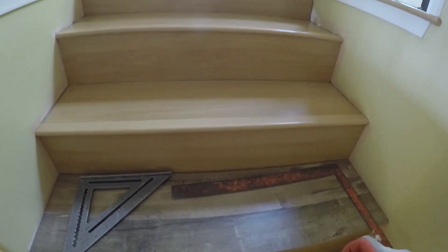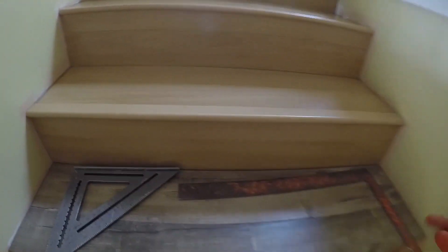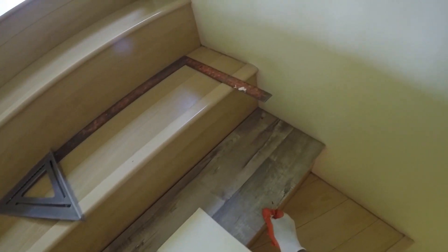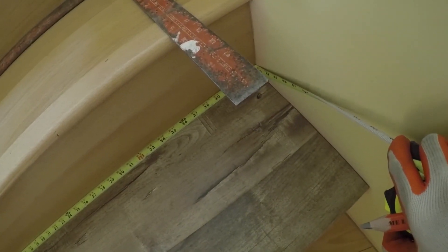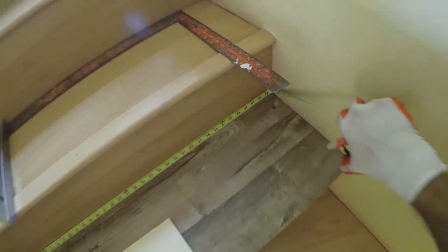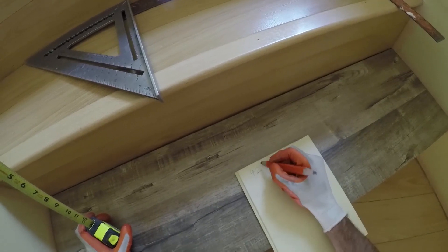So now it goes from this point to this point — it's resting against these corners. There's about an eighth of an inch, 3/16th of an inch gap here. This square is supposed to be right there, so it tells me there's a gap. But the true square shows this gap is twice more than what the framing square was showing — about 1/16th of an inch versus half that. In older homes where the middle stringers have sagged, gaps can be anywhere from an eighth to a quarter inch or more. So I rest it against the back wall, shove it into a corner, take the back measure, and make it about 1/16th of an inch shorter — I want my piece to just drop in without scratching walls or fighting it. So 42 and 11/16ths is my 3/4-tight measure minus 1/16th of an inch.